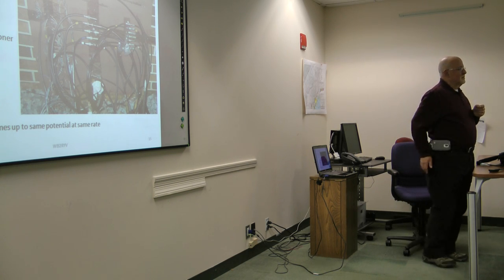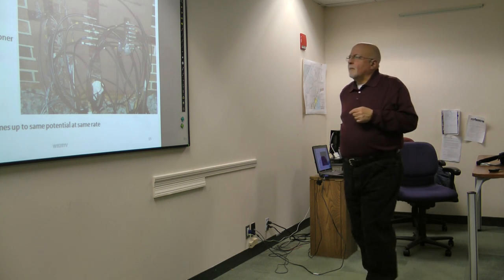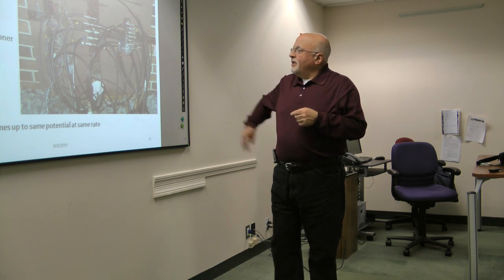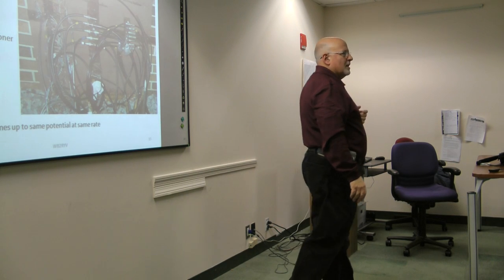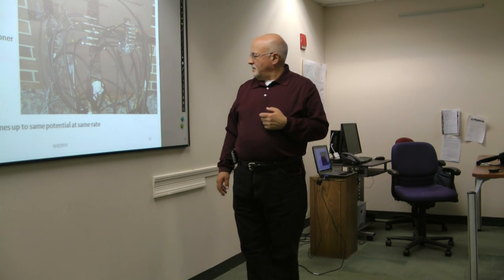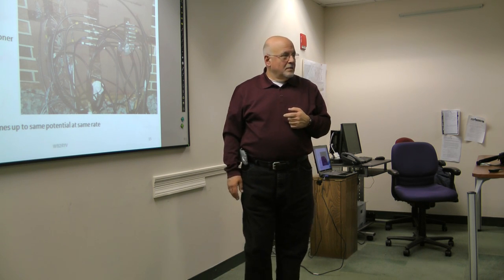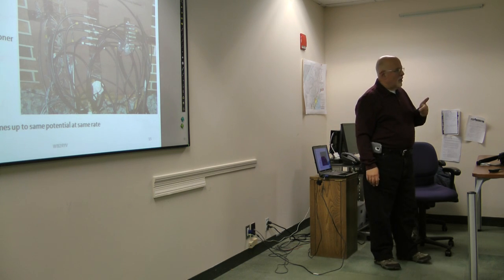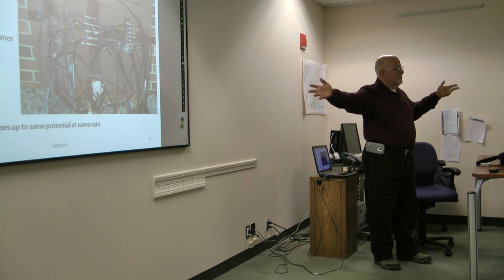Are those just barrels for ground connectors, or are they the units that will blow when lightning hits? These here are just the barrels. Okay. Things like the lightning arresters would be outside. Well, actually, they would be close, but as far as I know, there are none of them in this picture. Okay. And again, they should be close because you want them tied to that same ground. Otherwise, you're going to wind up with ground loops.